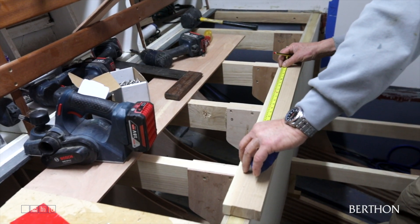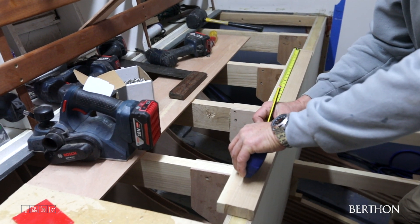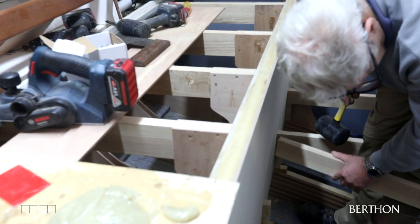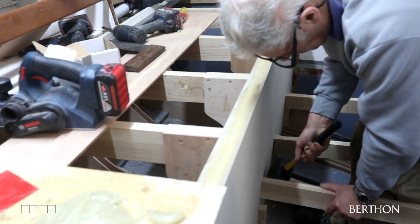The wedges are glued into place and screwed down into the beam. The upright is then glued down and screwed through the bunk front into the structure behind. This will create a stronger support — rather than sitting at a harsh 45 degree angle, it will all be squared at 90 degrees.